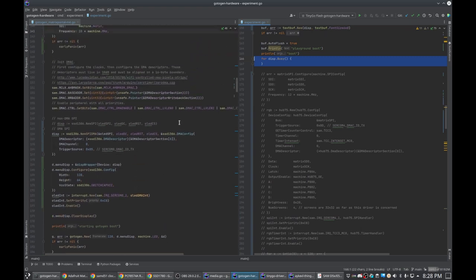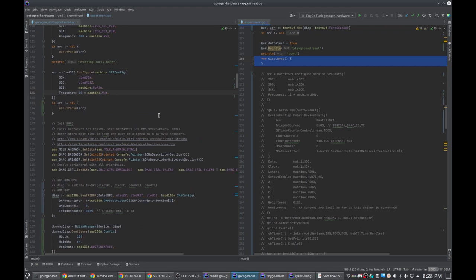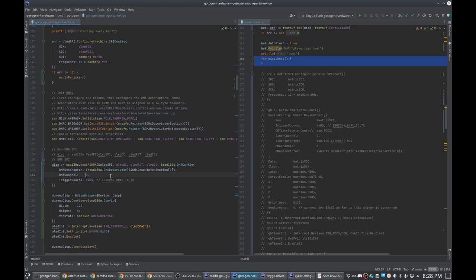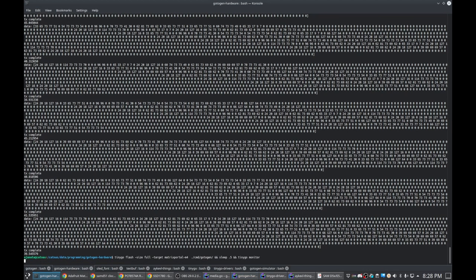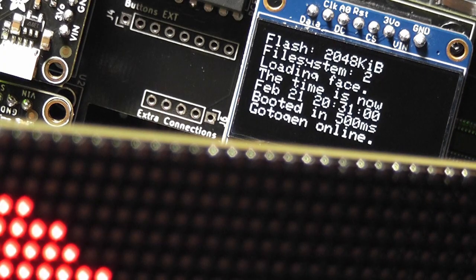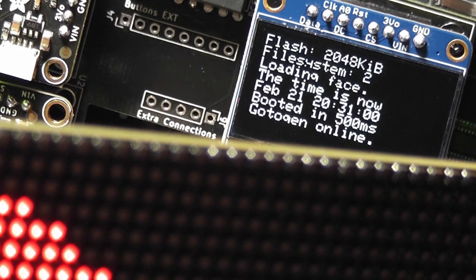Okay, that'll do it. I thought I needed to switch this one to use 0, but the other one's using 0, so I need this one to use 1. I thought I was being smart by switching that, but I think I was being dumb. Because it's getting to the point where it's trying to initialize the LEDs on top of the same DMA channel. But I thought I was already using, or still using 1 on that, not 0, so that's my bad. I just wasted some time. Hey, there we go. Look at that. Bada bing, bada boom. Let's go ahead and clear that off.